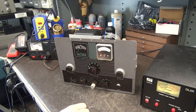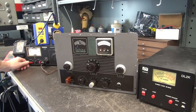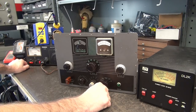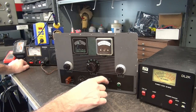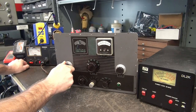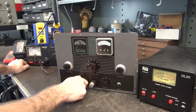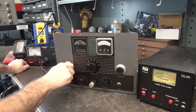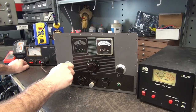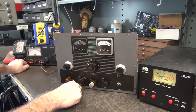Let's get a crystal on it and see if I can get any activity on that meter. I've set my variac for about 75 volts. We're still in tune, looking for grid drive at this point. Nothing yet — and there's that famous Johnson meter. We've got grid.